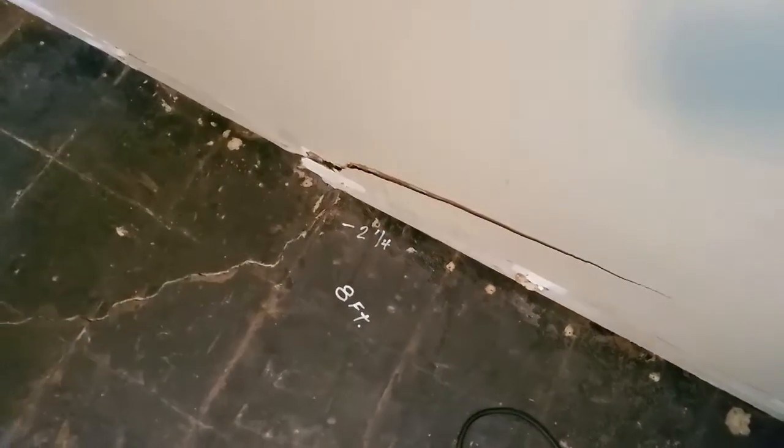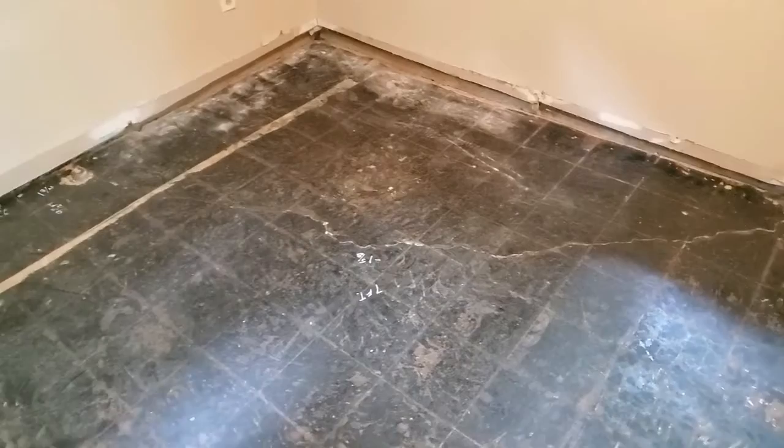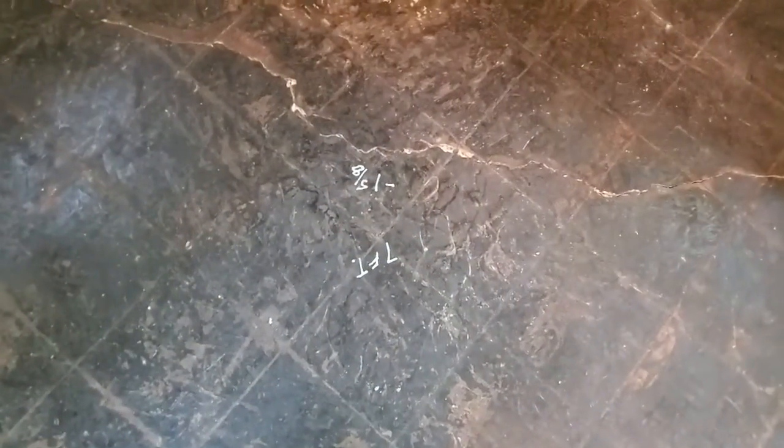Let's go over here. Eight feet from zero, it's two and a quarter low. Now you got a crack running across here. The DES is coming in here today to jack this portion up, this whole corner, and we'll just get it level from the crack back to that corner. It's inch and five-eighths low, seven feet from zero.